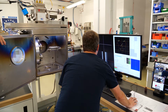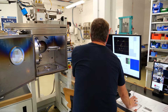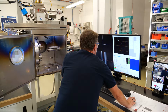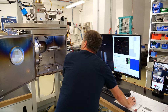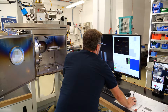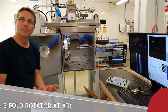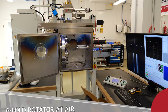The welding, the workpiece manipulation and everything is a G-code based program, as all CNCs. We have 6 synchronous axes, and there is a lot of related things which are not synchronous, which are M codes, which are macros, and these macros are all interfacing between the CNC control and the beam control software. Pumping down is 80 seconds for this type of chamber. We're gonna see it in a couple of minutes when we are pumping the whole beast down.